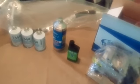Found out it was the compressor — just old. This was the original compressor on the car and it had about 171,000 miles on it. So it wasn't about a major failure or contaminants in the system, it was just an old compressor that needed to come out. After we're done with this, everything should work fine and the AC should run colder, because it wasn't running as cold as it used to before it started making this noise. Hopefully that will fix everything. Until next video, see ya.